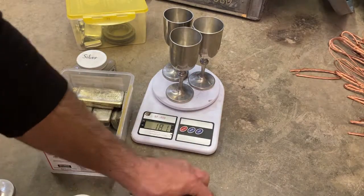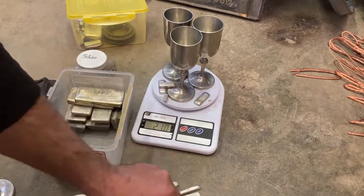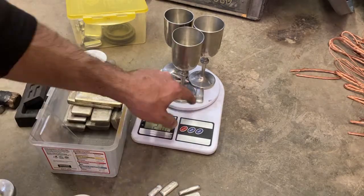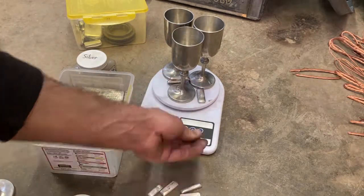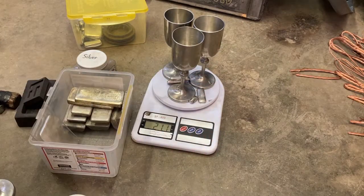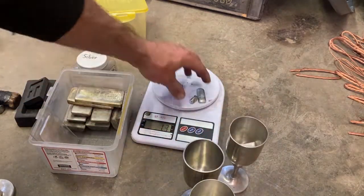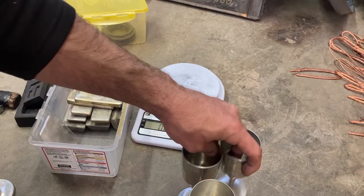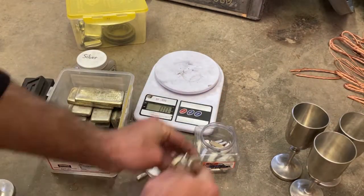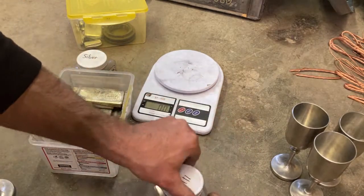That's another way that I was able to learn from watching their channels. I thought, oh dang, I need to get a fresh crucible for every type of metal I want to do, and basically every alloy, and really keep them separated so that I don't have cross-contamination of impurities or different mixes, right? Just good, clean metal.